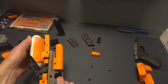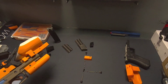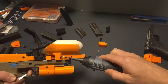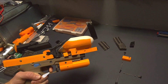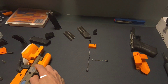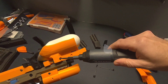When we have our reset, this screw here is what determines the length of pull. So if I wanted to have a really short reset, I'd go up to the point where it just breaks right past here before the reset — that's where I'd have the set screw set up. There's a very short reset because as soon as that happens it's stopping. This other screw determines the over travel after it breaks.